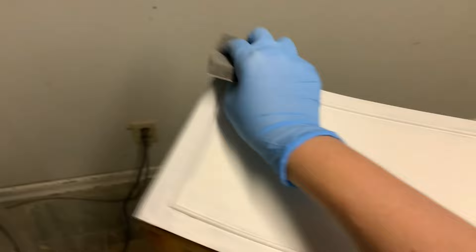This is to fill in the little nooks and crannies that you may have missed. I did miss some with Bondo and they were very obvious to me once I primed. So I applied the wood fill, gave it a light sanding, and then you have to prime over your wood fill again, because you don't want discoloration in your paint.